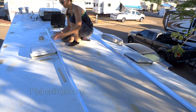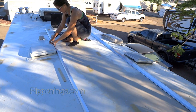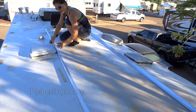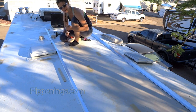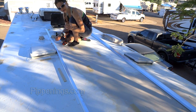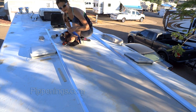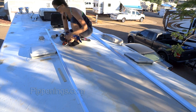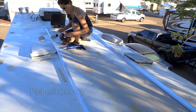I'm going to start my first hole here in the middle because there are a bunch of obstacles right here, and that'll kind of hold it down where I don't have much give. I want to make sure this one's pretty solid. I'm going to start by drilling a pilot hole and then I've got my screw. I'm definitely going to use some caulking on the screw as I drive it down into the hole, and then I'll try to push some more caulking in on top when I'm done.